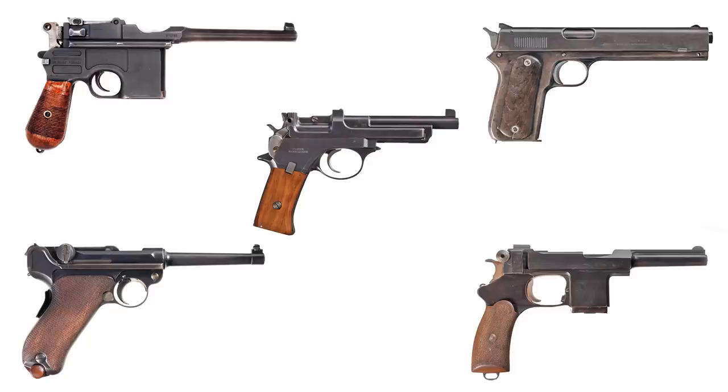Look at these guns — big names: Mauser, Luger, Bergman, Colt, and others. But the designs? I'm not seeing it. Maybe that Colt seems pretty modern, but it is not yet a locked breech. Nobody knows that's the direction everybody's going to go. Now this isn't the first Nambu, it's the second one, but it has primarily the same features — enough so that when we look at that field of guns, I will point out this is a short recoil locking action.